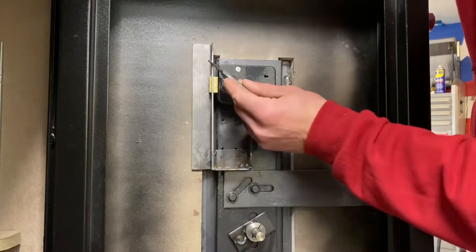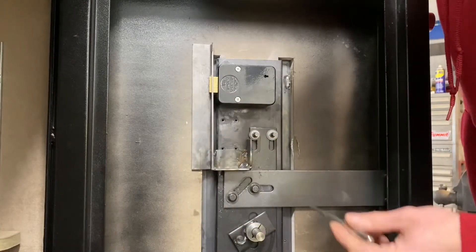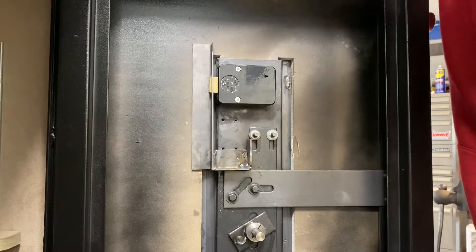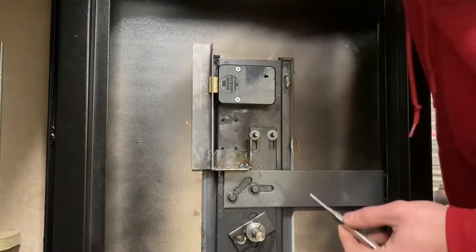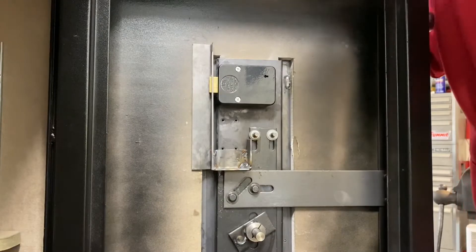It's simple, but it works. I just welded these two angle pieces together. I milled my slot — as you've seen on my Bridgeport. You could do that by hand with a carbide burr in a drill if you had to; it just won't look as pretty, but it works. I oversized it a little to get clearance so nothing's binding.